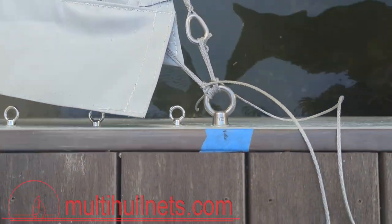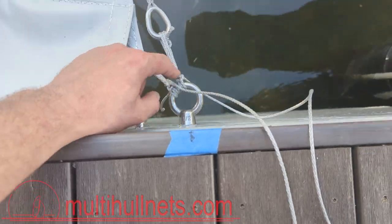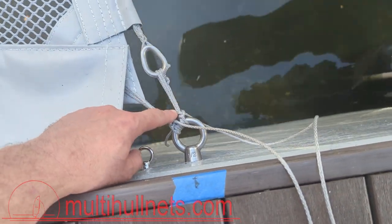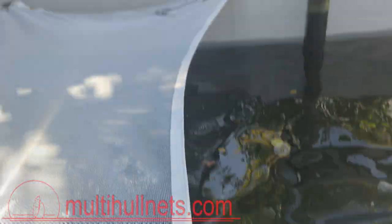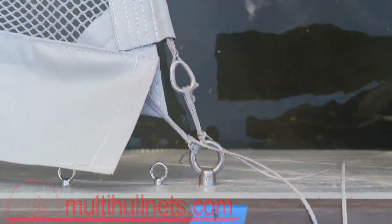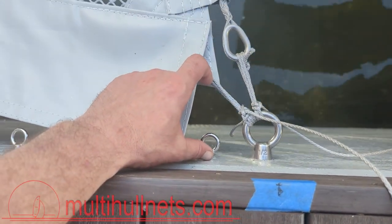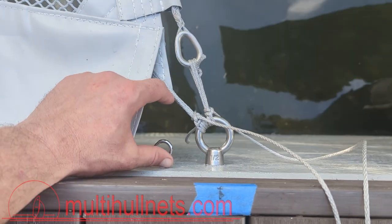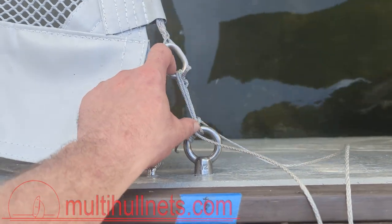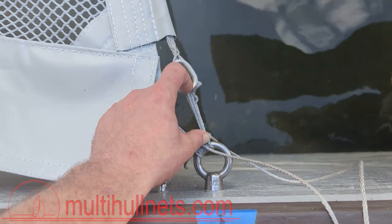You're going to put three wraps here — I just have it temporarily cinched off with a couple of half hitches. Three wraps here, temporarily cinched off with a couple of half hitches, and identical over there. What I'm trying to get to is the spacing on the drawing — it calls for three inches here, which is right about where I'm sitting. So I'm trying to get this point to final and this distance to final, as shown on the drawing.